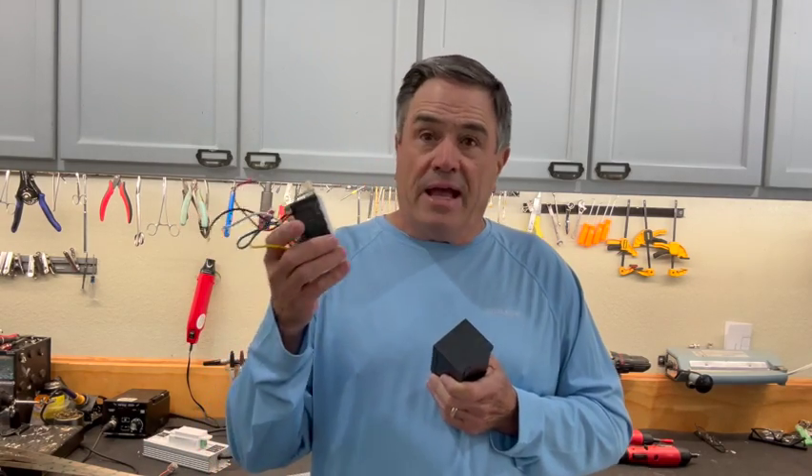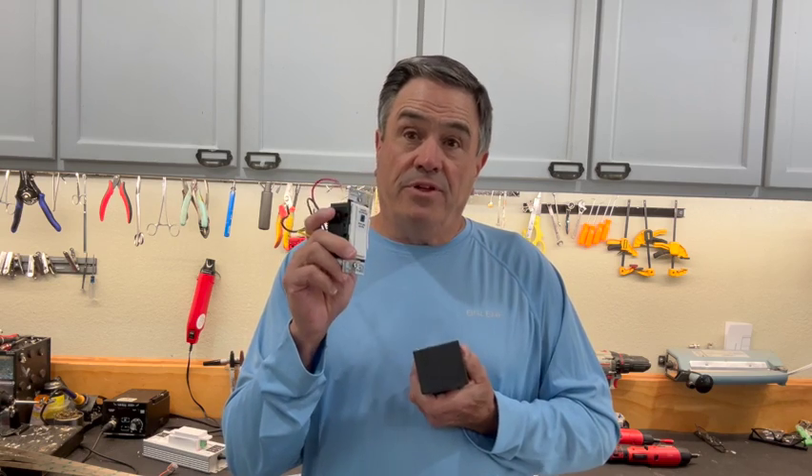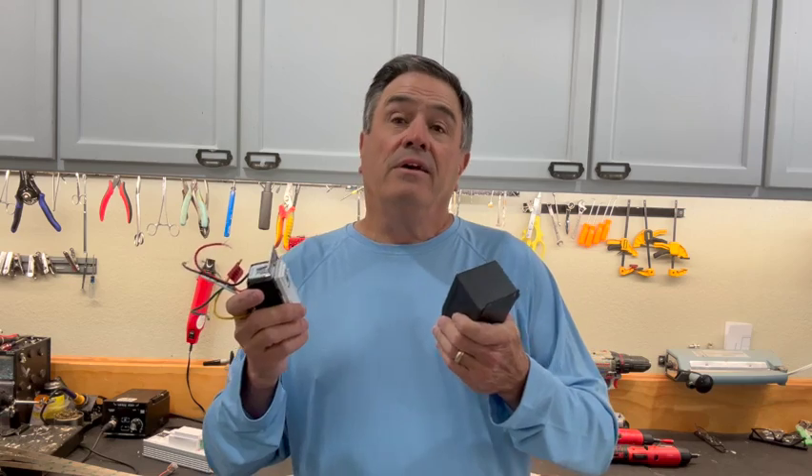Right now I want to talk about the switching. This is a magnetic low voltage dimmer, and you want to be sure that you see an MLV rating to operate with magnetic transformers. This particular one is a Leviton — it's my favorite. It will operate up to 600 watts MLV and it's voice activated with Alexa, Google, HomeKit, and Siri. You can program different light levels and times, and it also works as just a normal everyday lighting switch or dimmer.